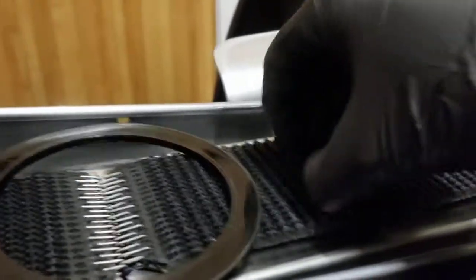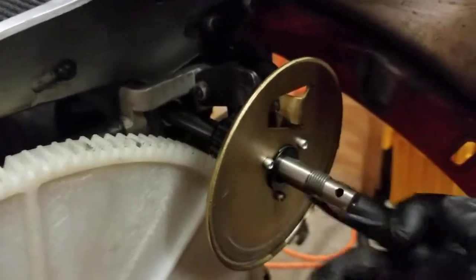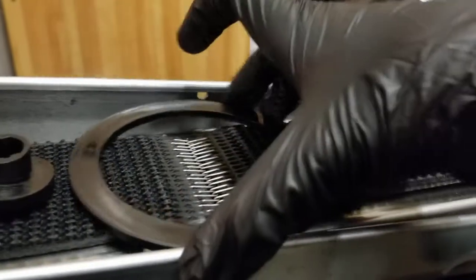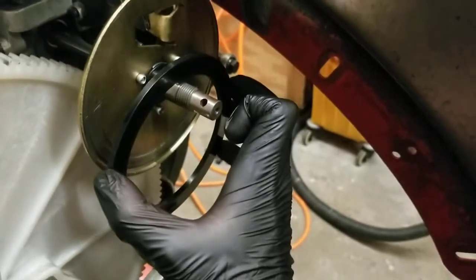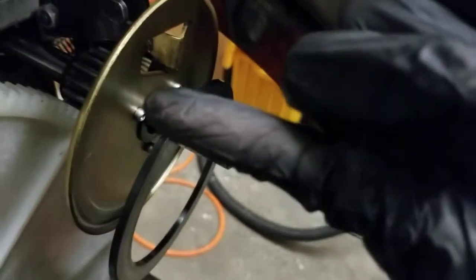Next up, that one washer. The two thin washers are identical. Then take this plastic friction disc and, as much as possible, handle it on the outside surface so you're not touching the actual friction surface. It's not going to stay here, so go ahead and hang it off to one side. Don't hang it too close because there's oil in there and you don't want that.